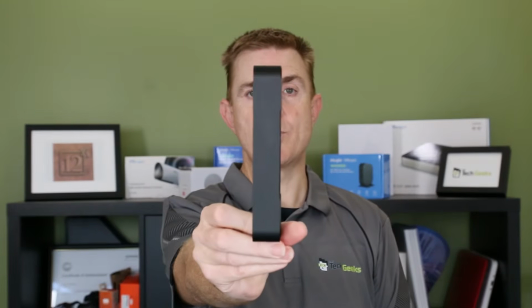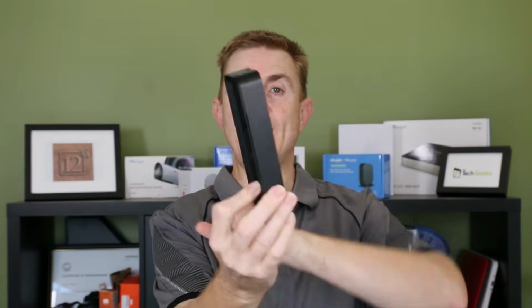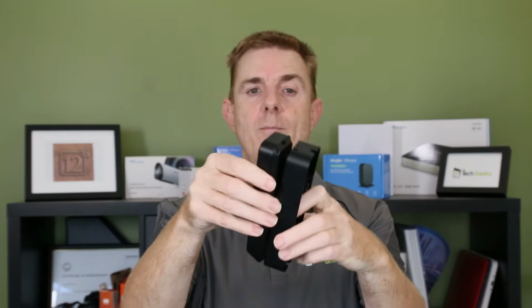It's not removable off the front of your house, but in one of those little packets you do get a little release pin like this that you can now insert into the hole, and that will unlock it. So that is your starting plate, but obviously your final bit. You get a straight through mounting plate. So this would be, if you want to put this straight facing on the door frame, or wherever you're going to put that, you're going to put this plate that we've just talked about in situ here. You're going to screw that fully into the wall in place. And then like we said, we're going to then bring the doorbell up to that like this, and that is going to be your straight through position.